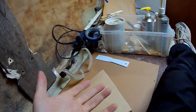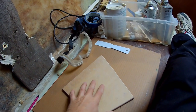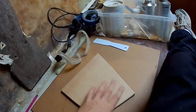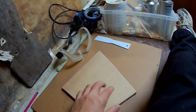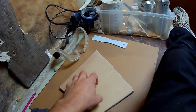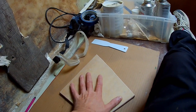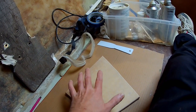By the way, I forgot to say, I always say this, but one of the reasons when I stuck that other piece up that it stuck on is I always wet everything else out with just normal epoxy mixed, both the surface of this and the roof, and then let it go to that tacky stage, a little bit like when you put your finger on sellotape and then put it on. It just helps to get everything soak into the little, I mean, this has had peel ply on it, so obviously it's like sort of Velcro to get everything sucked into it, because this is the mechanical bond bit. And then when you put the rest of the epoxy on, the joint between what's already on here and the other epoxy is the really strong chemical bond.